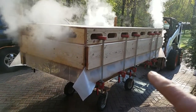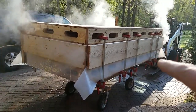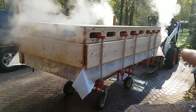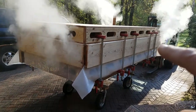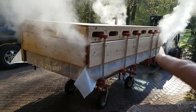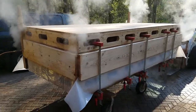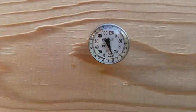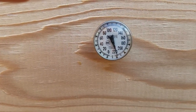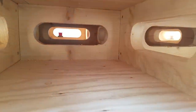Down there you can see that polyurethane — that's six-mil poly between the inch-and-a-half pine and the top of the torsion box. With the steam temperature being 220 degrees and all the moisture for three hours, you wouldn't want that against the plywood on the surface of the torsion box. You can see the top of the torsion box, and my temperature is running at about 220 degrees. You can see through the torsion boxes here — that's how they're constructed.